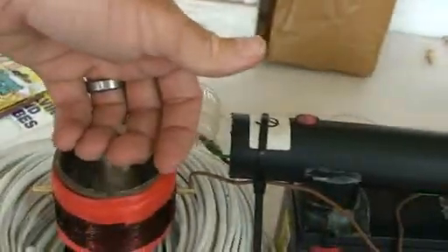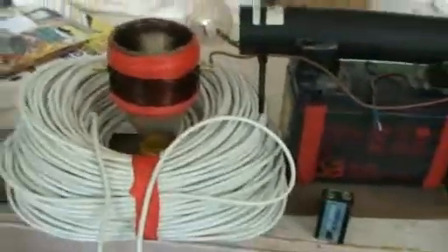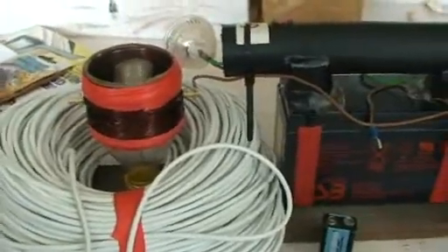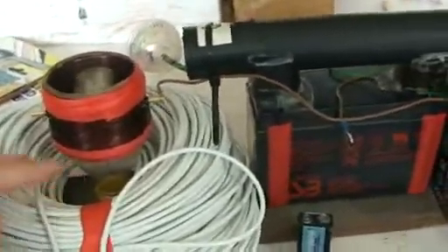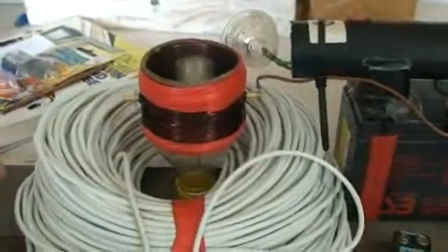And obviously as you go closer, we get full magnetic interference where the thing is actually spinning in my hand. So these neodymium magnets are incredibly powerful — very strong. Should be able to get a huge effect. If I connect the secondary coil in series to this primary coil here, the motor actually slows down, which is also interesting. Maybe because I am magnetically loading it on one side of the magnet — the secondary winding is essentially below the magnet, as opposed to being sort of in the middle. Any comments on that too? Thanks, bye.